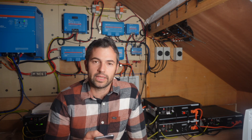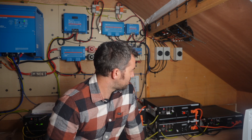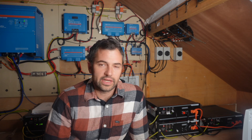So just hide it — that is the answer. That's your warranty right there. We're still none the wiser. What I'm going to do today is move battery 6 over to the end — we're going to try this. The light's going to go out and I'll have very little light because I've got to switch everything off: PV off, inverter off, batteries off, switch them over, put it all back on again, and then try that out.